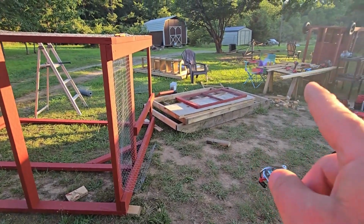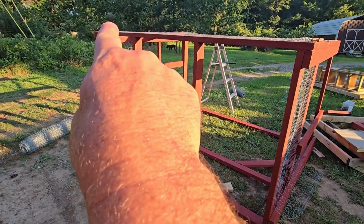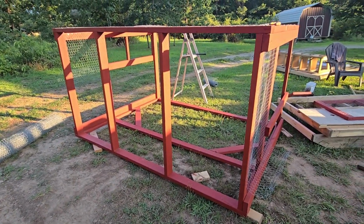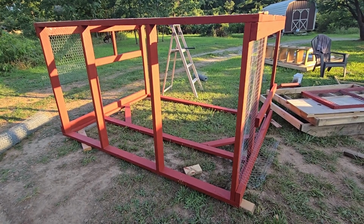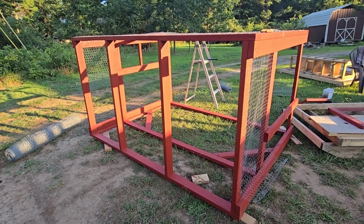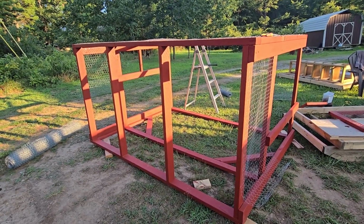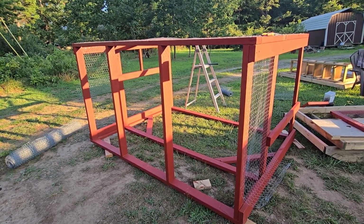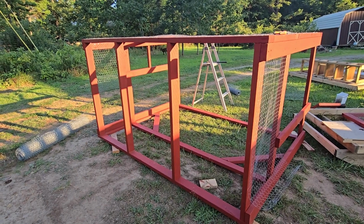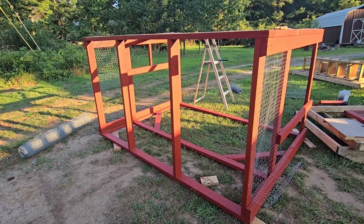So now I have to use another 2x4. Well, actually two, because I have to have nailers there to staple the chicken wire to. No excuse, but it's been so long since I framed and did construction, I find myself repeatedly forgetting to take into account the width of the 2x and the joists and stuff. So let this be a lesson to double check your measurements, because now I have to use another $8 in wood to fix my mistake. Plus, I have to paint and everything else. So just don't make the mistakes I do, guys.